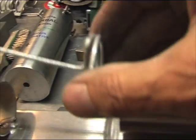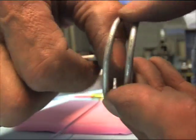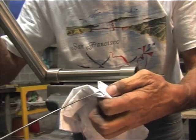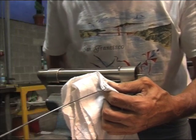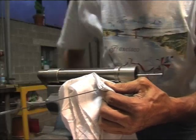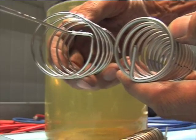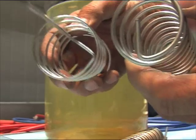You take it out like this. This spiral needs to be opened — it has to go like this, and this is hard work to do on 1/8th of an inch stainless steel, I guarantee you that. And there you have your spiral. You have the wire that is inside; this is the other piece of wire. I suggest you take a glove or a piece of cloth and then you start. Maintain a steady speed. Every time it gives a tick — tick, tick, tick — every time it turns. So bend it a little more so you have it around.